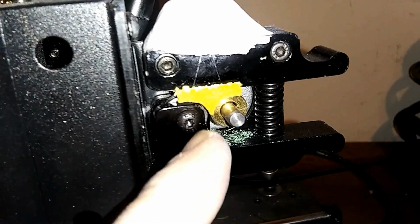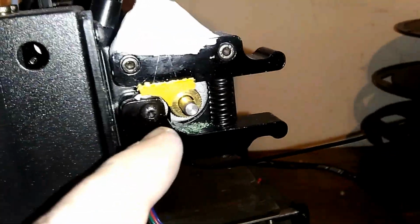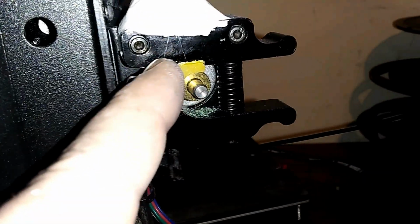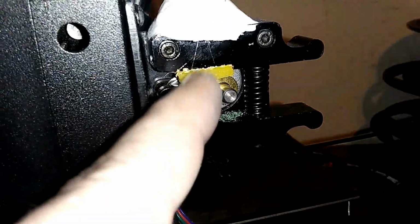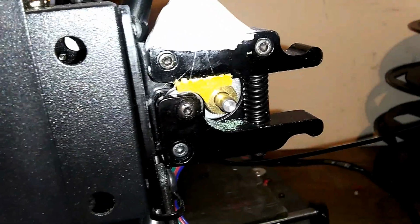And the tubing caused a bit of a problem sometimes. And a lot of people that print TPU tell you not to enable the retraction. But with this piece you can, and you get a really good print, a really good piece. So print this if you're using the Anycubic i3 Mega. It's a really good piece, and I'll put a link in the description for that.